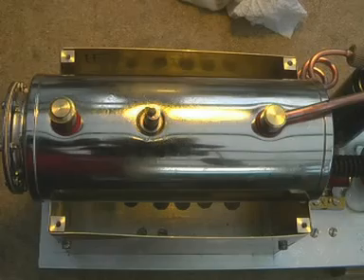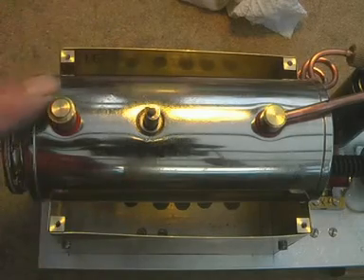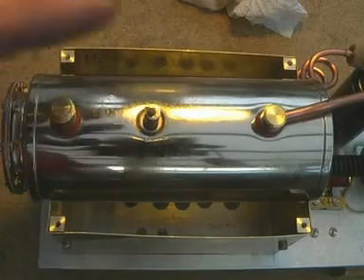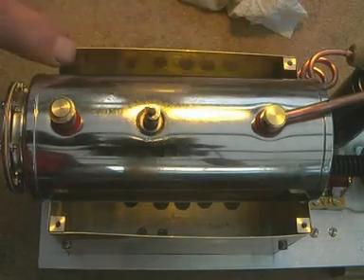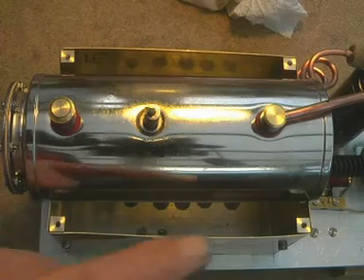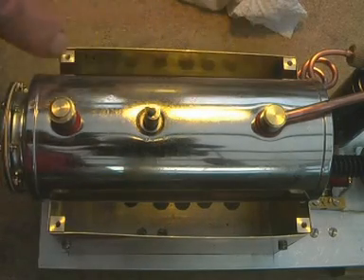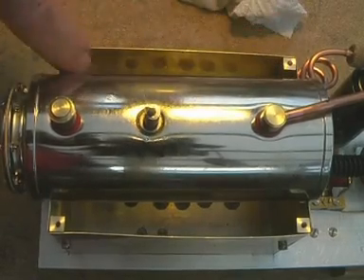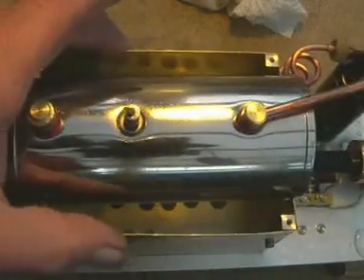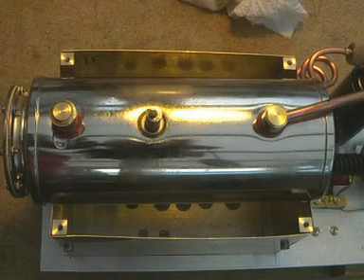It might work better after we've put the... I'll show you. This is obviously the boiler mount — it's the same size as the boiler mount on the Wilesco D16 engine which I've got. But the top is currently open. On these posts there will be a closure with a slot in to let the combustion products out. We're also going to put some asbestos substitute — modern, quarter inch thick — one pluck along there and another down there. That will help to keep some heat in, and then a top as I say. So that will be our next step.